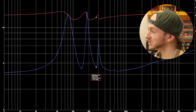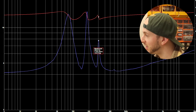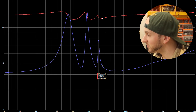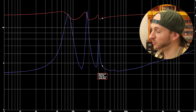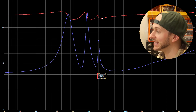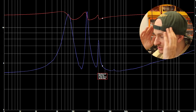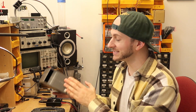After that, we rise sharply to what is probably the air spring of the first chamber, up at about 300 Hertz. The last frequency we play is 360, which is all the way up at the bottom of that third impedance spike - not at any port loading mode, not at any air spring. So I think that frequency is probably going to be quite weak and not very loud. But we'll see how it performs in real life. Let's whack it on the table and have a quick listen.